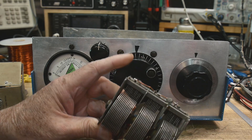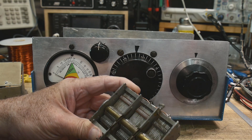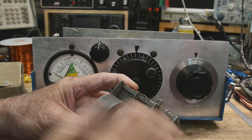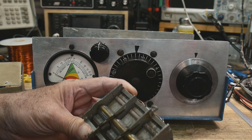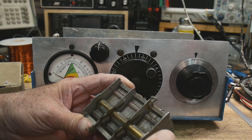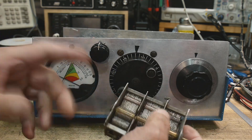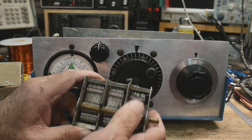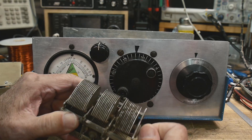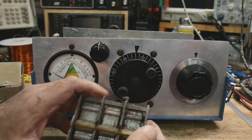It was just an old unit and it has very, very narrow spacing between the plates. If you look at professionally made versions of antenna tuners, they won't use these — they'll use a wider spacing between the contacts for higher voltages and stuff.